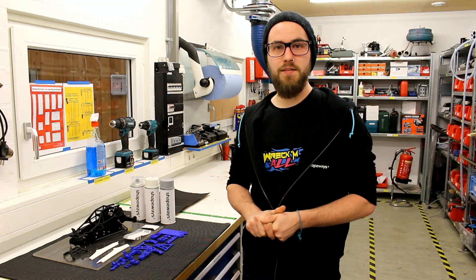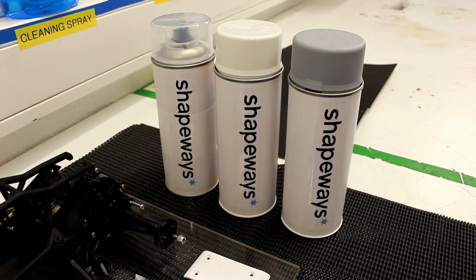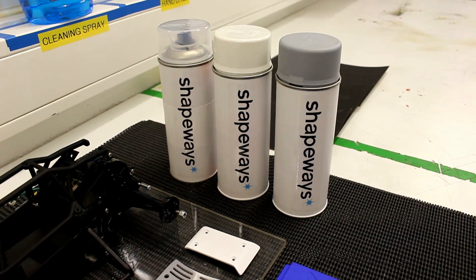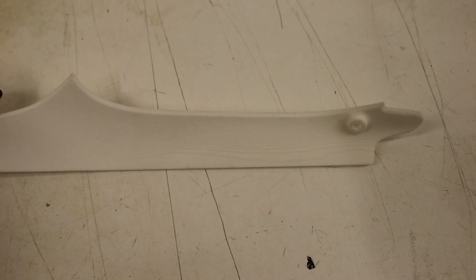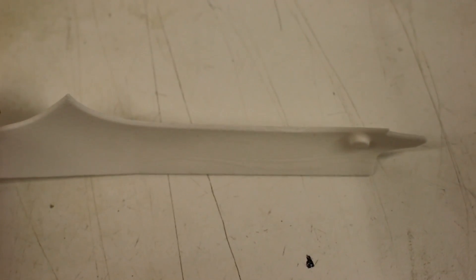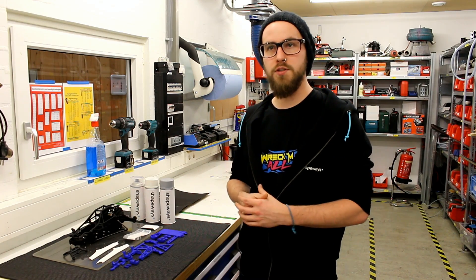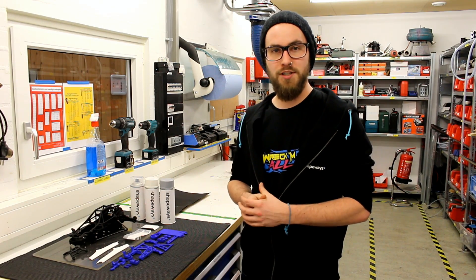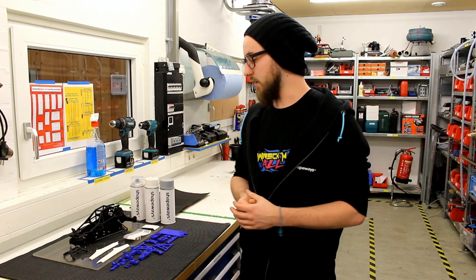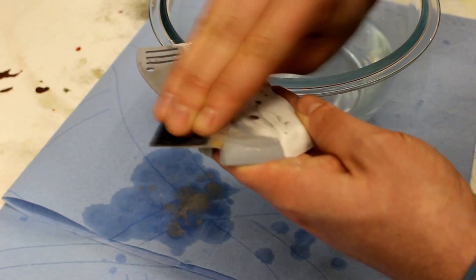For the next parts that we want to paint gloss white, you can see all the paints laid out next to them. We need to start with sanding. With 3D printing, one of the problems you have is stepping on the parts — especially on curved parts with a very small radius. They'll have some stepping that we need to sand off because it will show after painting. I start with a pretty coarse sandpaper — 180 grit — and move up to 400. I start by getting the rough parts, sand them with 180, then paint them with a normal grey primer made for plastics.